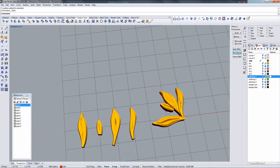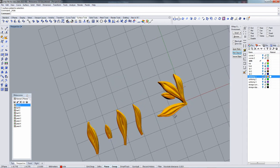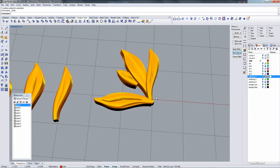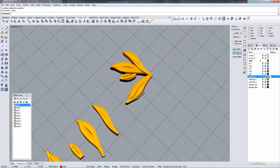the leaves. This would be the same process that I will do for the petals of the flower, and then I would need to come up with an assembly system, which I would envision being two rings, actually. I would crop the center out here with a metal ring. There'd be a metal ring on the petals, and I would solder the two rings together with a center post, which would be the center element. And that would allow me to clean and position both pieces.